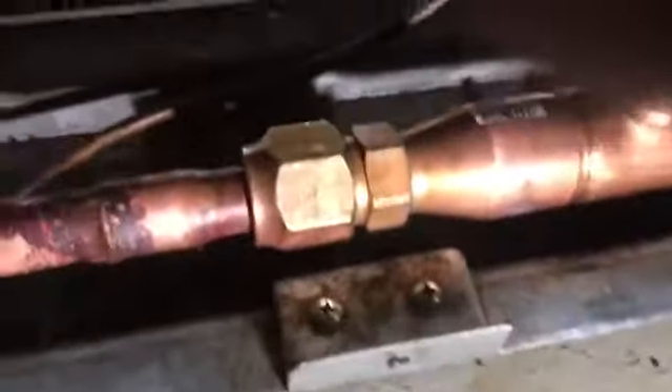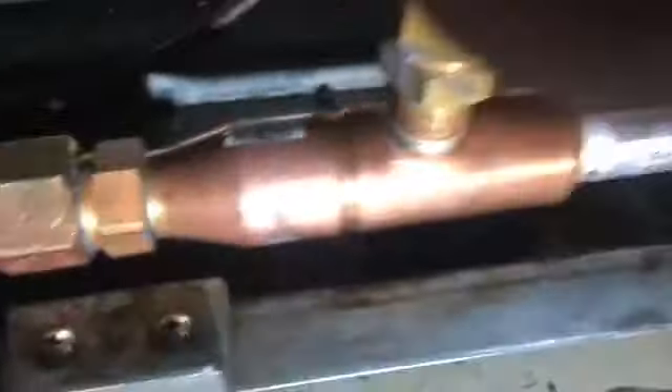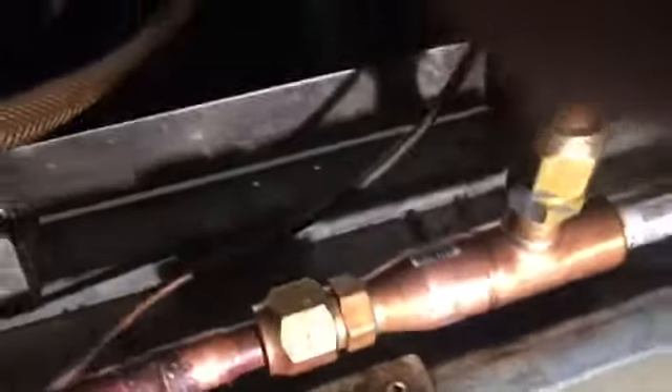Once you remove the cap, you'll see that it's leaking there. So this is my old valve, made by Sporlan. I got a Danfoss valve — it's a flare type; they did not have a sweat, so I did have to do a few modifications here, nothing major. It's in place already — let's test for leaks.